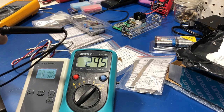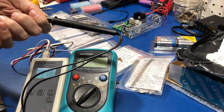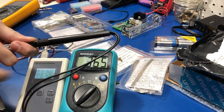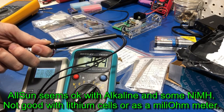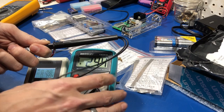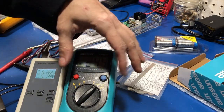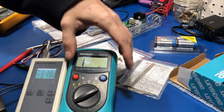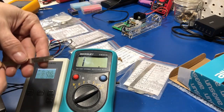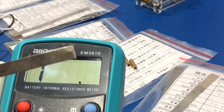I'm not jumping around as much — that's good. It's jumping around by about 10 milli-ohms. I don't know if that would be within its claimed specifications or not. Let's see if I can get it to stay still and get some pressure on this. That's probably going to be the best we're going to get — 244 versus 268. At least it's stable; it doesn't jump around as much as it does in the 200 milli-ohm range. The 200 milli-ohm range, I just cannot get to read anything accurate at all. If it's not a battery, if I press hard enough to damage the nickel strip — I mean, look how hard I had to press.